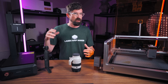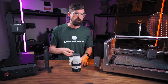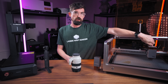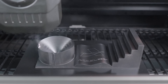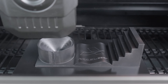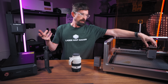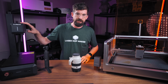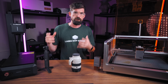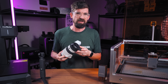We've talked about six axes, but there are actually more. The Z axis alone has three different ways it moves: traditional up-and-down on the gantry, the work bed itself moving up and down, and the focus mirror moving up and down. So counting it all up: X and Y on the gantry is two, X and Y on the galvo is four, then the Z up and down is five, the work bed up and down is six, and finally the focus mirror up and down is seven — so seven axes of movement, with one being focus. It kind of counts, kind of doesn't, but it's really cool.